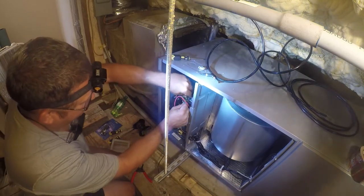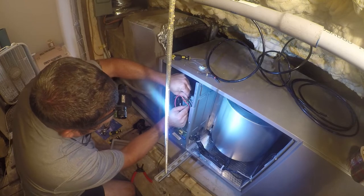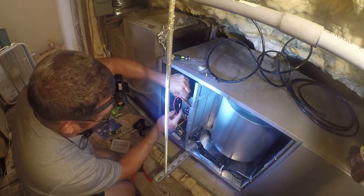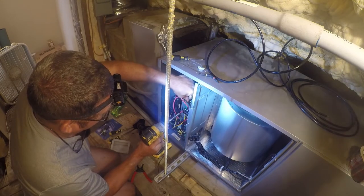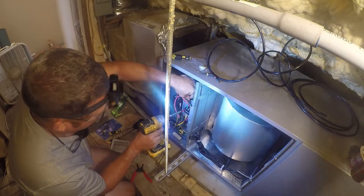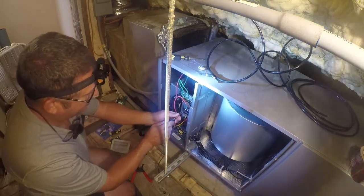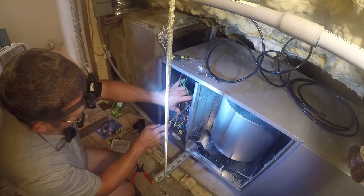And I kind of question if these conductors are really rated for 30 amps, which is what the ampacity is. I'm really shocked that they are using a 60 amp breaker in here, because it's not going to do anything. I mean, if they were using a 20 amp breaker in here, I'd be like, okay, they've chopped it down some. But yeah, they're not even doing that.